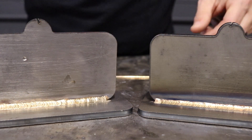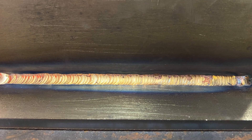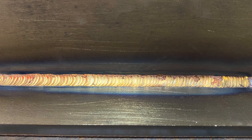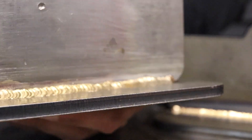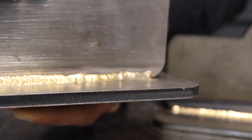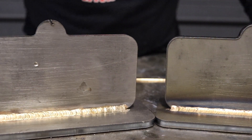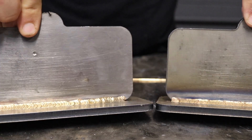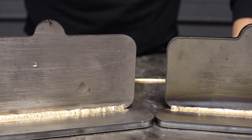The difference you'll really see is that with DC negative it doesn't quite clean all of the silicon off the base metal, whereas when we go with AC we have the negative and positive and it actually cleans it up a little bit better. So you can run steel on AC when we're talking about silicon bronze wire. They'll both work and you're going to get the same strength no matter what — it's just that one seems to be a little bit cleaner than the other.